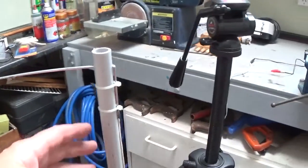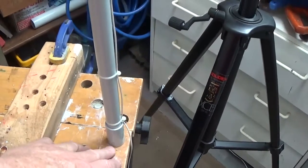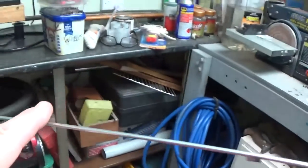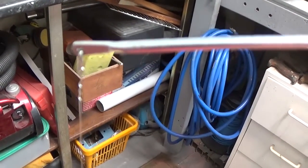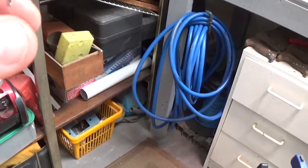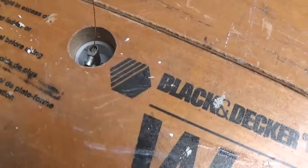But yeah, that's how we go about it. So just to recap, what we've got is a 20mm conduit post here with a joiner, and then there's another piece underneath which allows it to sit in the top of the Workmate here without being pushed through. To that we've added an umbrella strut, which has a little hole in the end, and attached to that I've got a little tack that's been bent over like a hook, and the nichrome wire has been wound around that.